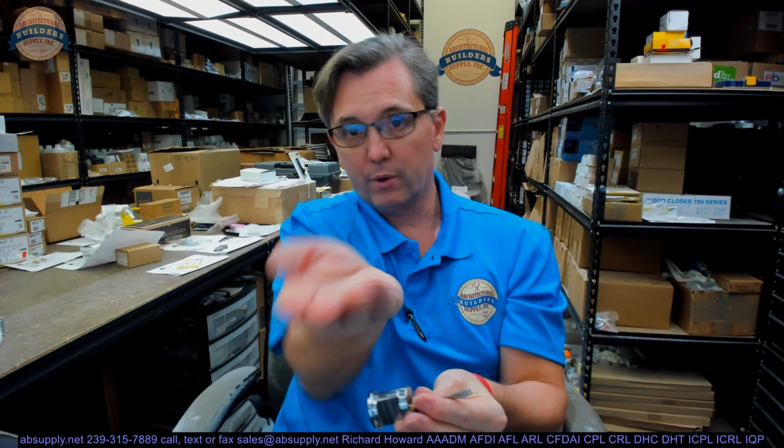And I explained to the client, when we got to the discovering of how that tailpiece was cut, it was bent, possibly imperceptibly, but that tailpiece has to be thoroughly laser beam straight. If it's bent at all, it will go through an arc or an ellipse sort of path as it travels around, and it will cause binding on the lock, the female portion of the lock that the tailpiece is entered into. So you're going to want to cut that carefully once you know what length it needs to be. Plus the client had cut it at a different length and we weren't able to discover why he chose a different length to cut the new tailpiece to and not match the original. But once the length was matched to the original and the tailpiece was hammered flat on the anvil part of his vise, it worked just perfect. So the moral of the story is cut that nice and straight, no bend to it.